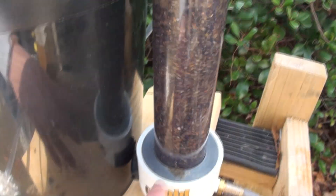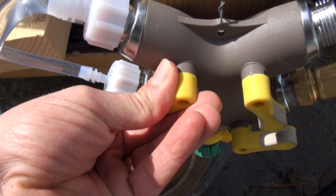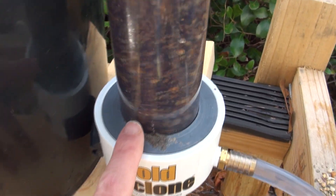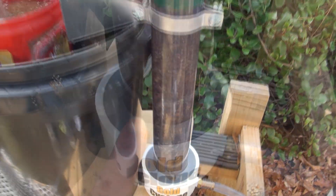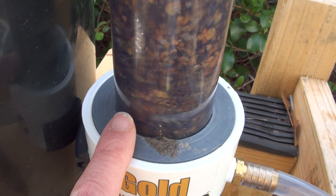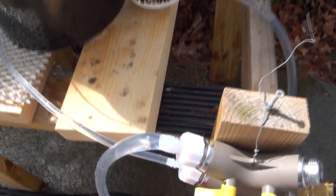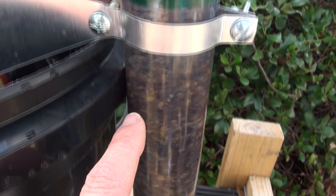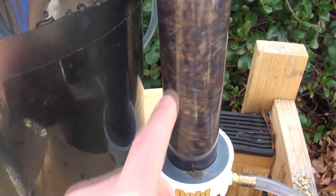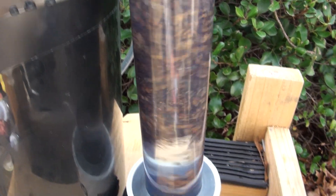Now I'm going to turn this up and start the action on it. Once I get it spinning, I'm going to give it a little bit of juice, then just watch and let it process for about five to ten seconds. At some point you'll start to see a clear gap in here — and there's your clear gap starting. I'm just giving it a little tweak, a little tweak. Let me shut off my upper funnel water — I keep forgetting to do that. These quarter-inch round rocks just pan off real nice.